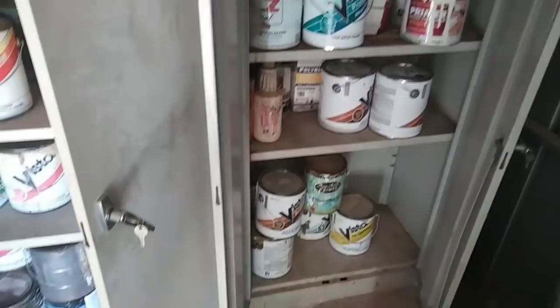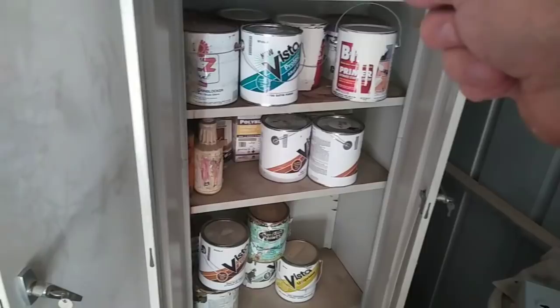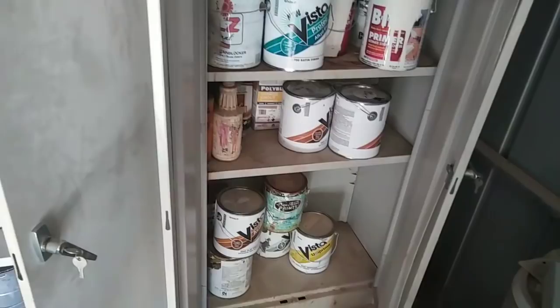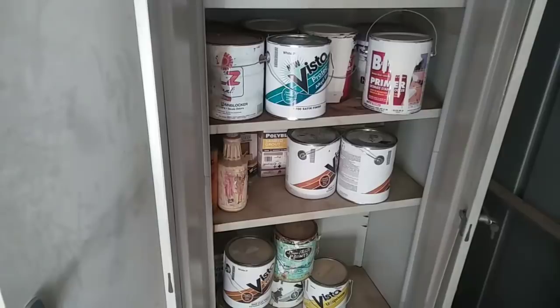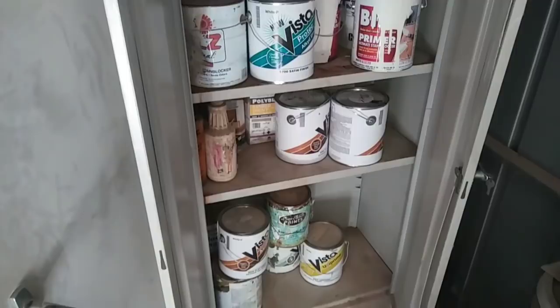I usually use an airless to apply the finish. So the workflow is: put the primer on with the turbine unit, then switch to an airless for any second primer coat and for the finish paint. Use a fine-finish tip on your airless to finish the job. That's really the only time I'll use a double-orifice tip — because everything in the kitchen is completely covered up, so I'm more focused on finish quality than overspray at that point.